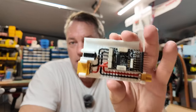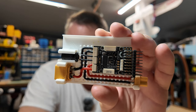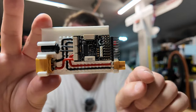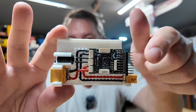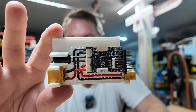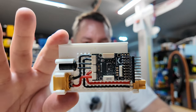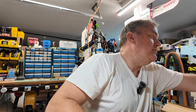I shifted away from the Matek boards and I've been getting more and more into the SpeedyBee boards. I think the SpeedyBee boards represent tremendous value. My most recent build for my pusher designs uses the pin-based design on the SpeedyBee F405 Wing Mini — DC power incoming from the battery, DC power going out to the motor, control surfaces routing out mid-flight-controller board to the servos, and a pigtail coming back for my ELRS receiver and GPS, which will sit high in the foam board.